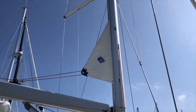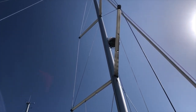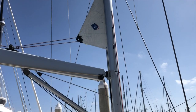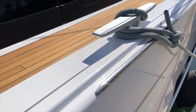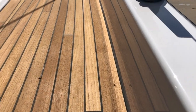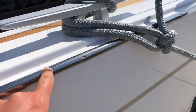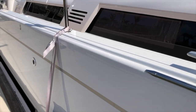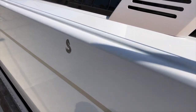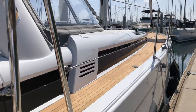This one's got an in-mast furling main, two spreaders — you can see spreader lights and radar on a Kato mount going up the mast. The toe rail of this boat is deep, so it's nice when you're walking forward, really comfortable. I also like the little touches like this stainless steel here which protects the boat with your dock lines and prevents chafe on the gel coat. This little seahorse is the Beneteau logo, but it's also marking where you'd want to put the straps if you're going to haul this boat out of the water.